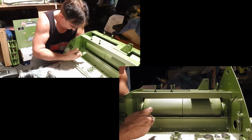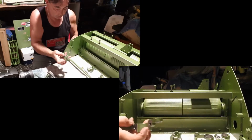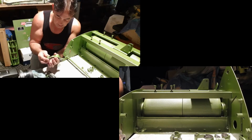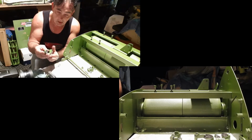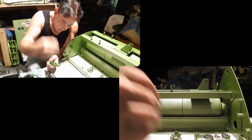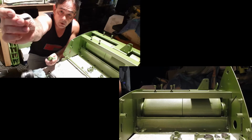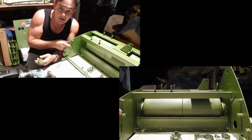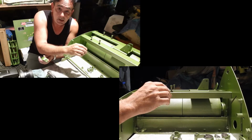I've got the front wheel bearing holders to put on. Now, here's the thing, when you're painting all these parts, all of these holes, every single one of them, don't let paint get into them, because all you're going to do is have yourself a whole heap of time with a knife, with sandpaper, rolling it up into little tiny rolls, getting into all the little holes. Even on the frame, you've got to go through with a knife, go around, get all the paint off of those holes,